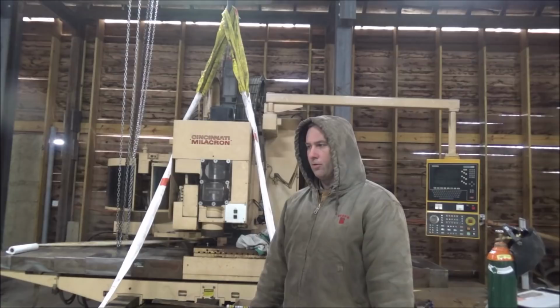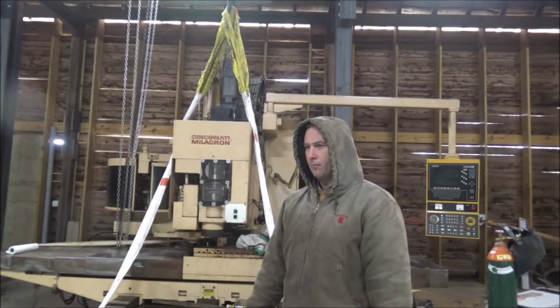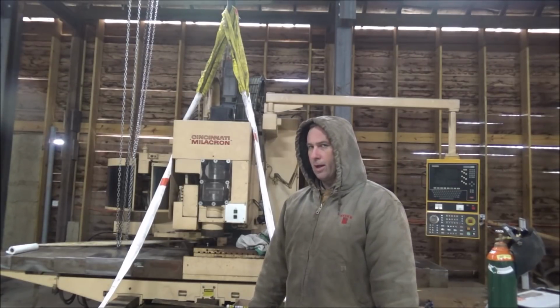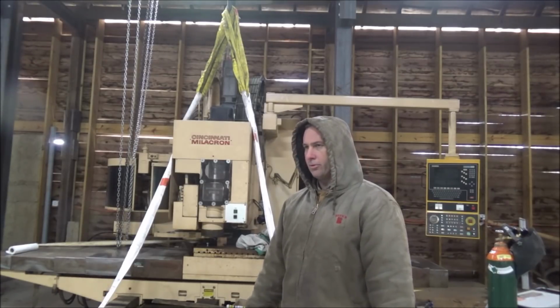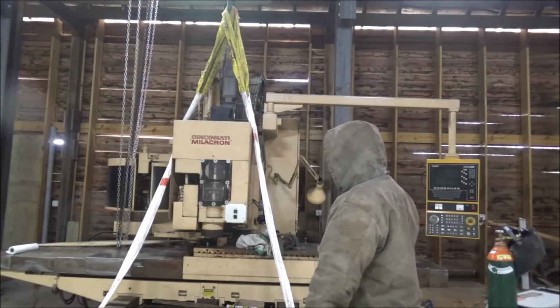That was one of the reasons for the thick, heavy slab, was to try to induce less deflection in it as weight went on and off of it, because the slab weight versus what you're adding to it gets to be a closer ratio than if it was like a 6-inch slab or something like that. You put 40,000 pounds on it, that's a lot of weight compared to what the slab itself is. Whereas these sections, they're 2 trucks a piece, so they're like probably 150,000 pounds, something. Anyway,